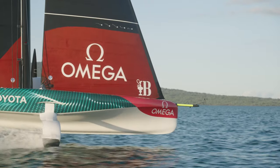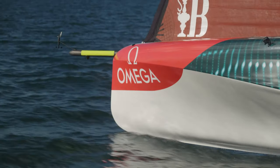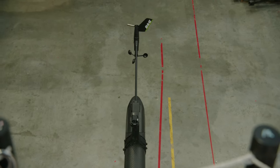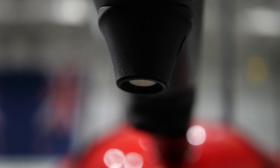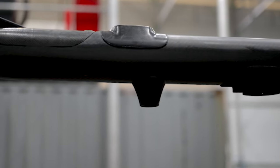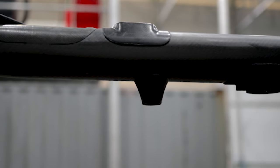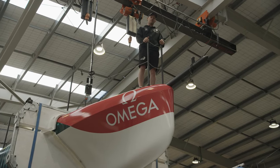The final thing — and probably the most important thing to look at on this boat — is what we call the ultrasonic. It's what senses how the boat's flying. It's the smallest little thing on the boat, but probably one of the most important. It shoots a beam down at the water, sensing how far the boat is off the water, and that is key for making the autopilot system work. I can guarantee you this is not as straightforward as it sounds. There's a lot of science that goes into making it work, and that's what makes the AC40 fly.